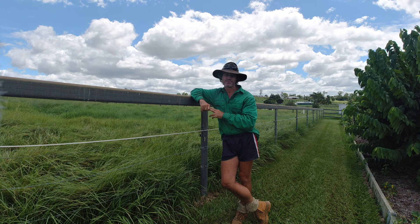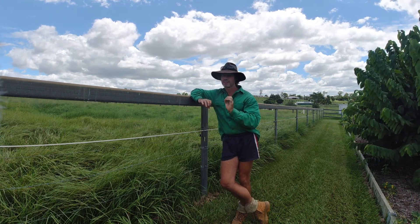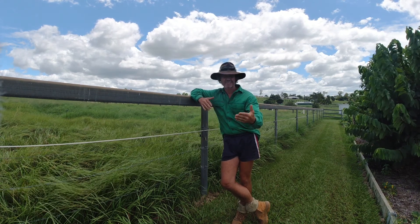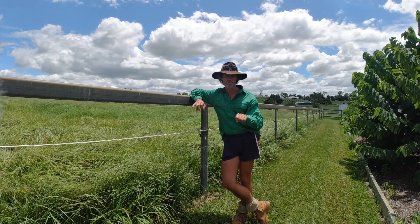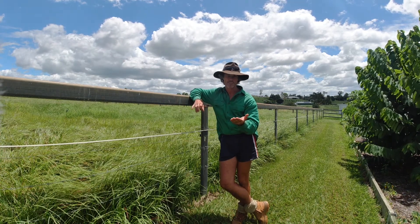A couple of those insulated wires may have cuts in them because they were zip-tied to the fence, so they may have worn through over time and be zapping against the fence. We've also used hollow tubing at our termination points and where some of our gates open up onto the wire, to thread over the wire so if the gates go against it, it won't short out.